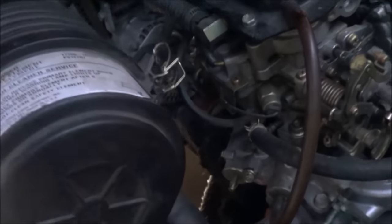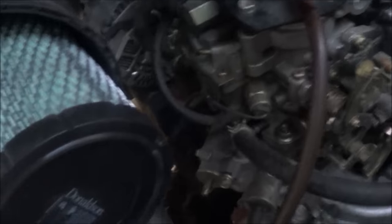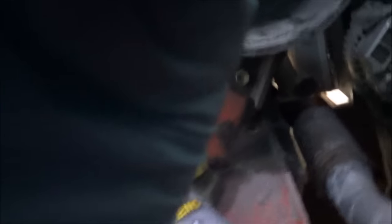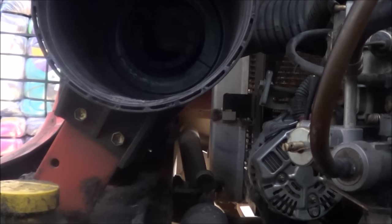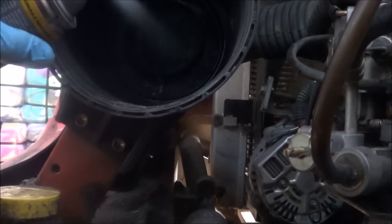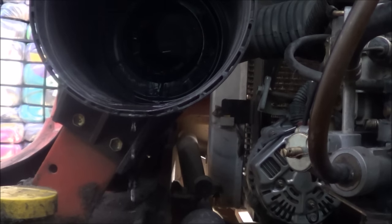The way I'm going to test for fuel is I'm going to take out the filter and then spray brake clean inside. I could do something better but right now I don't have anything else to use. Brake clean is combustible — I'm not going to run this for a very long time, I just want to know if we're lacking fuel. So I'm going to crank it and spray some brake clean inside. We are missing fuel — we know that because it started.